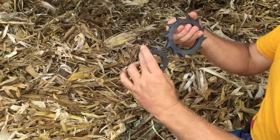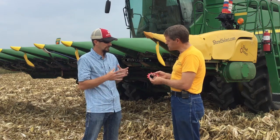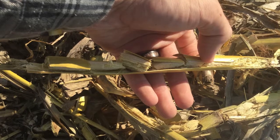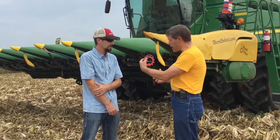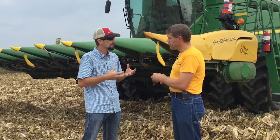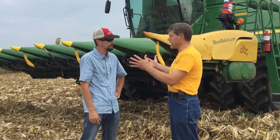We have the ability with different modules, different shapes of teeth, and different spacing with the rotary knives to process both the stalk diameter and the length — controlling how many pieces based on how many knives you put in. Rather than just poking or puncturing the stalk, we're actually tearing it apart as it goes through. This is the first we have seen in a field of actual shredding and actual opening, because everyone else tends to cut or open it, but they don't shred. They don't make the vertical openings that differential speed does.